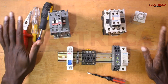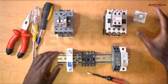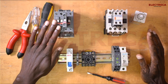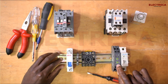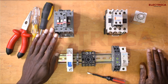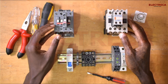Today we want to look at a very simple changeover switch. In this circuit we have two powers. We have this contactor as our gen contactor, this one as our main contactor, a control breaker, and a timer which will control the gen contactor. We also have a relay in the circuit. This contactor should be mechanically interlocked like this one.